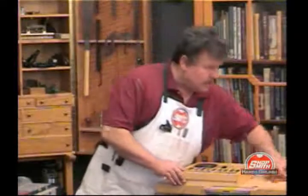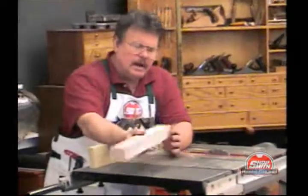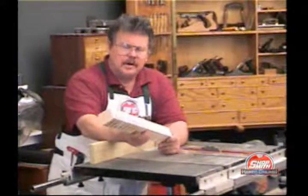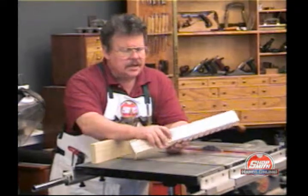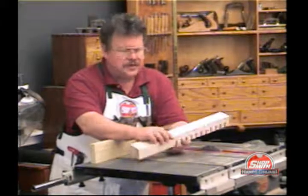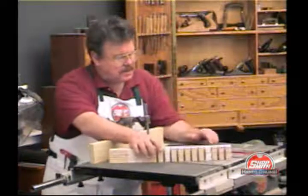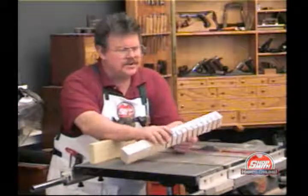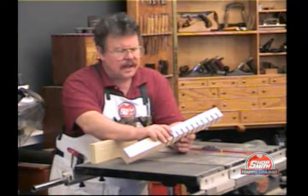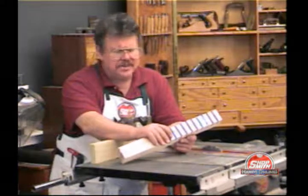This is not rocket surgery here. I have taken a bunch of strips — I'm using Baltic birch here because the Baltic birch you can get is closer to one quarter of an inch thick than anything else on the market. So you get tighter lap joints, because at the smallest you can make your dado cutter is one quarter of an inch. I have made this egg carton storage out of one eighth inch stock before, but it gets much too flimsy for woodworking tools. This seems to work much better.